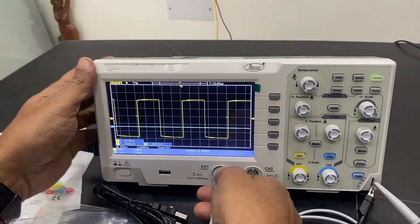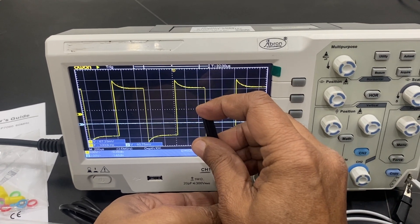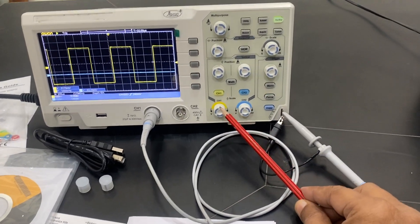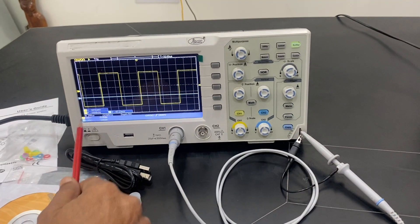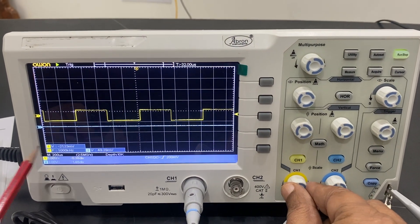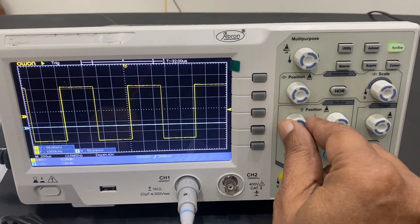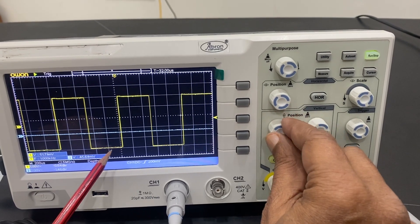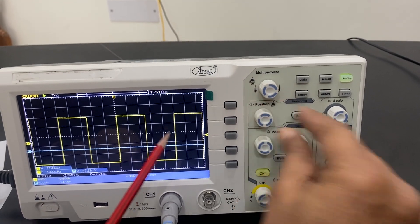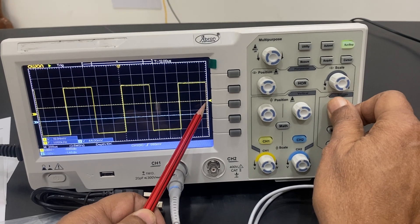Sometimes you can see the top of the waveform; you can adjust the screw to correct it so it appears as a clean flat line. There are different selections for channel one — it has a millivolt selection. It is currently set to one volt, and I can change it to two volts, five volts, and different ranges — the height of the waveform will change accordingly. I can position it at the lower bottom using the position adjustment.